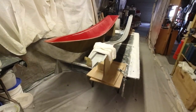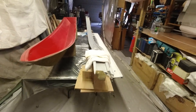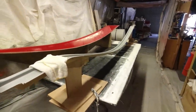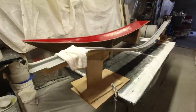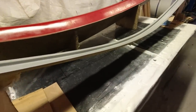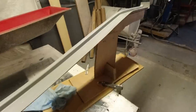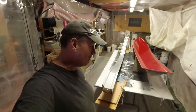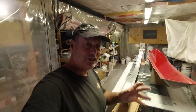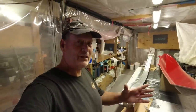I've put these off for such a long time because there's a little bit of work involved. This small long slender mold here is a ridge cap mold for the stern of the boat - basically a transom mold that'll cover the joint between the deck and the hull. I was going to do it in carbon to have a nice black carbon seam along the back of the boat, but in the Australian heat that could potentially be a disaster - they tend to go yellow because the epoxy really isn't great in UV.